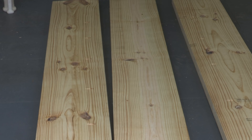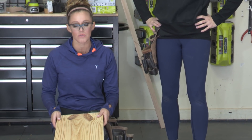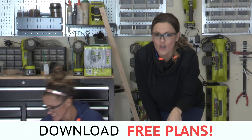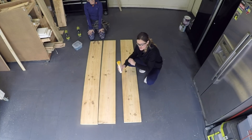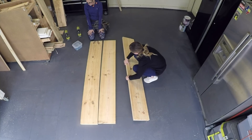Alright Ash, what are we doing first here? The first step is to plank the tabletop and this is super easy because we're starting with the big guys — just three 2x12s. I did go ahead and rip both sides so that we would have nice smooth straight edges. I ripped them at ten and a half inches wide. But you don't have to remember that — you can download the free plans. Just click the link below and it'll give you all the measurements.